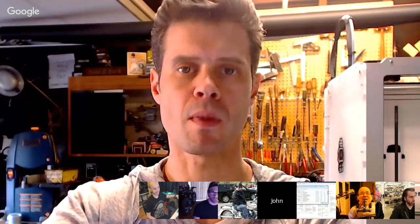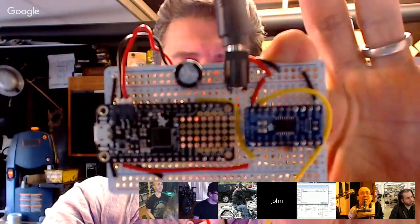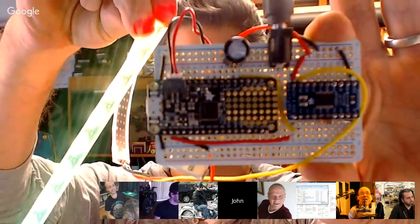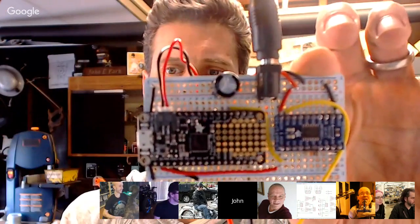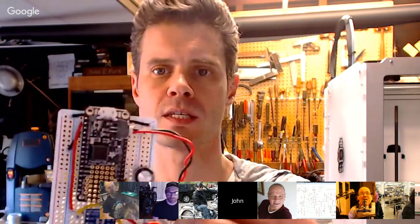John Park, what you got going on this week? Hey, so this week I have a little video that I'm working on. It'll be out tomorrow, I think, and it's kind of a twofer. What I'm showing is a little level shifter that I'm using. This is the 8-channel level shifter, so that I'll be able to power 8 different strips of NeoPixels for a later project. This allows me to use the 3.3 volt microcontroller with the 5 volt NeoPixels. And I'm also showing just transferring your project from a breadboard into one of these nice little perma-proto boards.